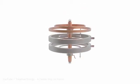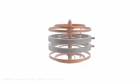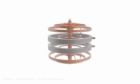These are the vertical field coils, upper, medium and lower. They provide an inward force to control the size of the plasma ring. And finally, these are the Super X coils. They are part of the divertor, and they allow us to drag the diverted particles out over a larger area to reduce the heat on the wall.